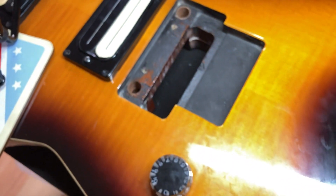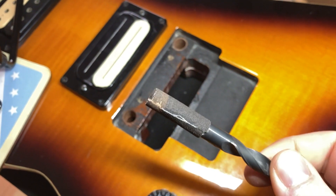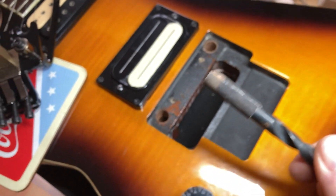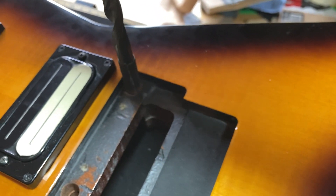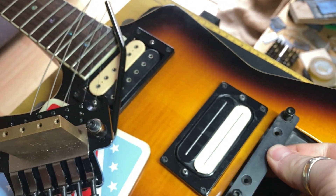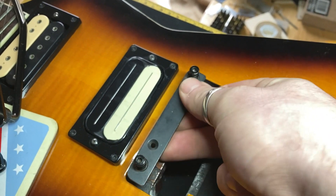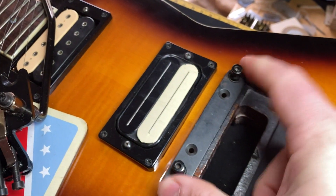That is working. Then the last thing I'll do is use a smaller drill bit — this is a 9.5mm — with a piece of 120-grit wrapped around it, double-sided taped on, literally just used as a sanding stick. That fits in really snugly — you can hear how snug that is. I'll go down with that afterwards just to make sure it's nice and smooth and there are no burrs left. That's the plan. I can already feel it going in when I press it — it stops because it's on size, but it is fitting nice and tight.